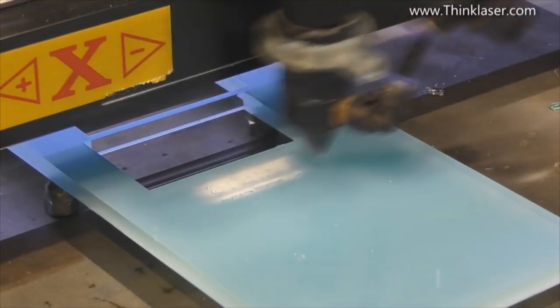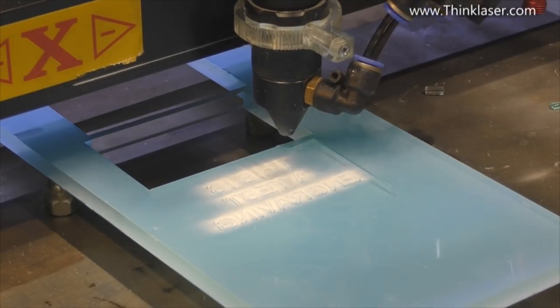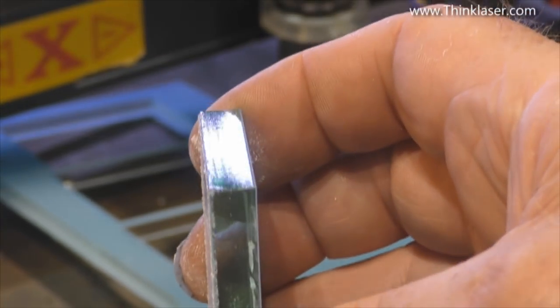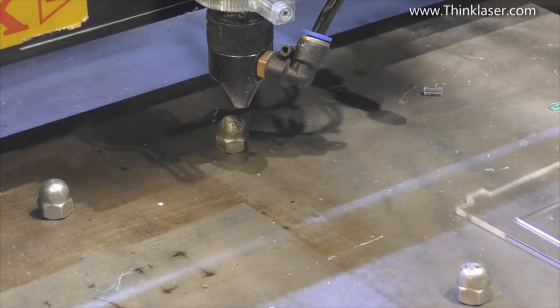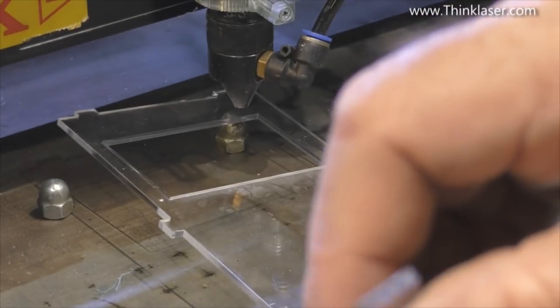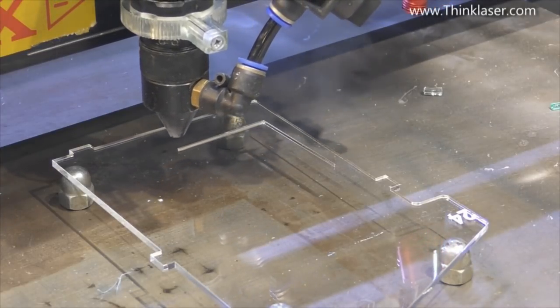There are our mirror polished edges. As it clearly says on there: cast acrylic has a name on one side and film on the other. Unfortunately I don't have any 5mm cast acrylic, so we're going to have to use 8mm thick and repeat this last test - air assist, 50% power, with the film. In the dark surface you can see: the one on the left is cast acrylic, the one on the right is extruded acrylic. When it comes to engraving you would choose cast acrylic every time because it gives a much cleaner, crisper result.